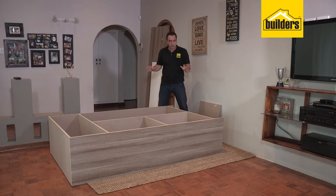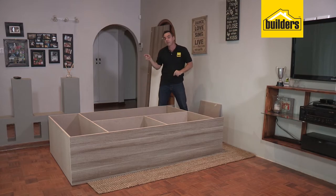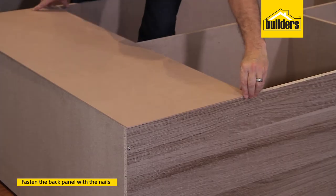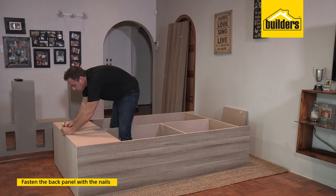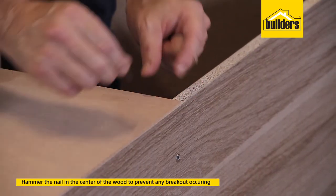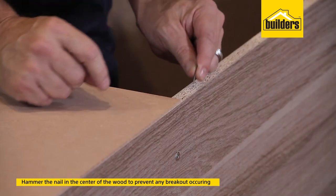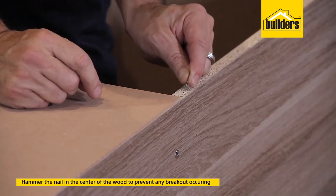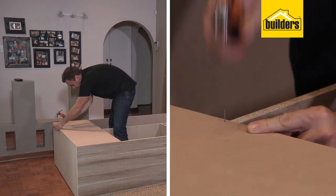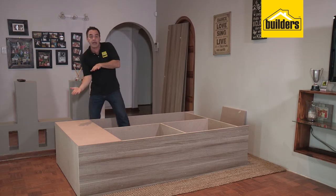All the structural panels are in — the structure is complete. While it's still lying flat, put the backing board on the top section and drive in the panel pins to secure it to the back of the unit. When driving in your panel pins, ensure they're sitting in the middle of the edge of the wood — that will prevent any bursting out the sides. If you go too close to the sides, the nail will go towards the edge and damage the outer surface of the panel. That's the backing board complete.